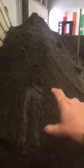This machine will do a maximum of 3 bags of lime, so that will give you 60 shovelfuls of sand. And FYI, that is a loosely interpreted number. If you get 63, 64, 59, at those points you're getting in the area that you actually want to look in the mixer and observe your mortar. Look at it. Say, all right, what does that look like? Does it look like it's sticking too much? A consistency of peanut butter is a pretty good analogy of what you're looking at. Very fluffy peanut butter. All right.